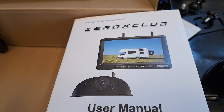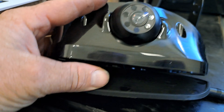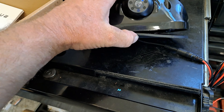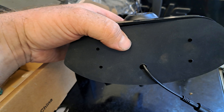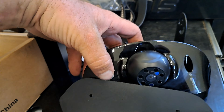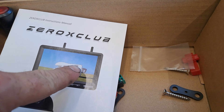The camera: all I did was pop the wire through and put this little gasket on. At this point you've got to make a plan, because it's not designed to be put on and taken off repeatedly. There are four holes you'll have to drill — make sure you have the tools to drill through metal. If you're mounting it up near the roof, you need to seal it really well. I'd use a high-quality outdoor-rated waterproof silicone — I'd silicone the base gasket and where it meets the plastic.